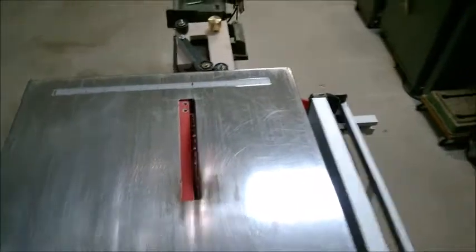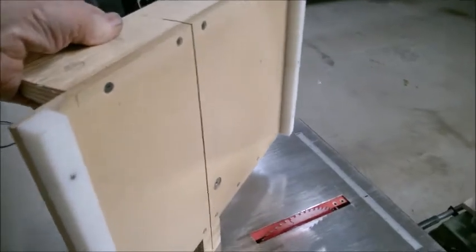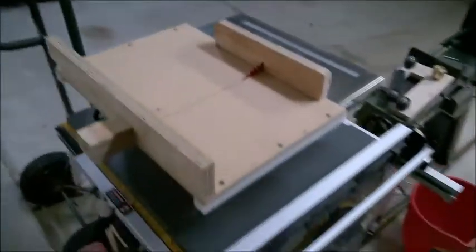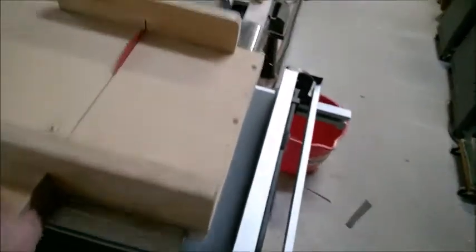The other downside is that it doesn't have any slot for a miter gauge. What I've done is made a sled for it — this sled slides on here, and rather than riding in a guide it has two UHMW (ultra-high molecular weight) slippery plastic runners on either side that fit down either side of the metal table. By fitting those carefully, it slides nicely with absolutely no play whatsoever. With this little sled you can crosscut pieces. It's made with three-eighths-inch-thick particle board, so the maximum depth of cut is about an inch, which covers most of my stuff at three-quarters or less.